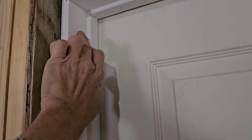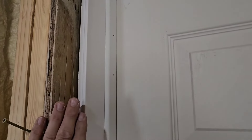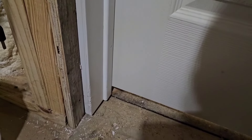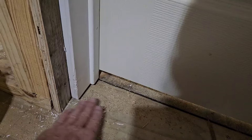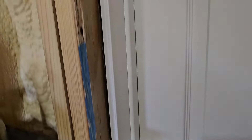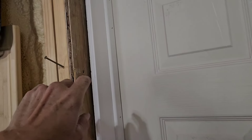I'm setting these doors. I like to fasten the side that has the hinges first and make sure that side is nice and plumb and where I want it — I don't shim this side. I'll just push it all the way to the top and I'm leaving about 5/8 of an inch gap at the bottom to allow for quarter-inch hardy backer, tile, and tile adhesive. That way I can just slide the tile under it. I'll make sure I've got my half-inch sticking out on the other side for the sheetrock thickness to meet the trim.